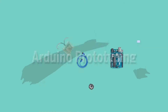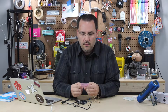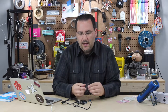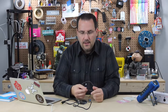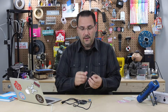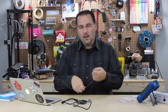Now let's take a look at thermocouples. They're a little more complicated to use, but they have a few more advantages. Today we're going to be looking at this 8495 breakout board from Adafruit with a K-type thermocouple. The big difference is these type of thermocouples — you can see the end here, quite small, encased in glass — can measure a much larger range from about negative 25 degrees C to about 700 degrees C. So unlike other thermometers and thermistors, you have a much wider range and it's also a lot more accurate.